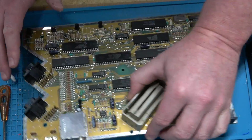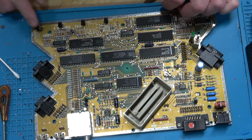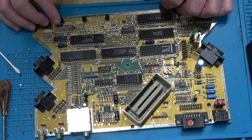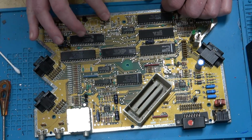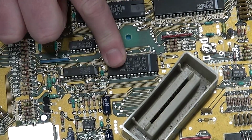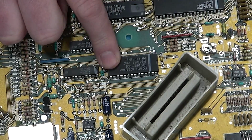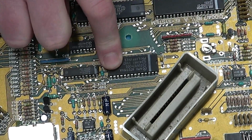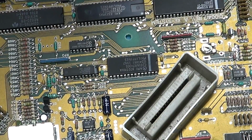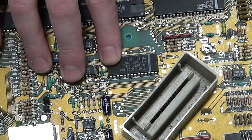What is causing it not to... Well, the weird thing is that it's not even booting to, like, BASIC. Wait, didn't this have built-in Missile Command? I want to say, yeah, the mask ROM is 16K, and the top one of the 8K banks is... Oh, wait, no, it would be bigger than that. It would be like 24K: 8K of OS, 8K of BASIC, and then another 8K of Missile Command.